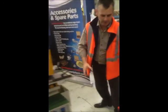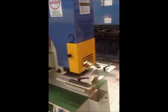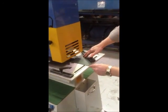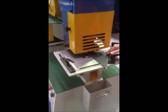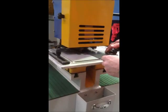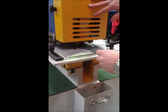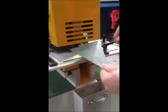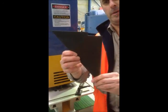On the opposite end we have another foot pedal for our notching station. Just a little bit of 1.5mm sheet metal here. Again set up on your guides with our pedal — and we can notch, as you can see. Nice big guard there to keep everything safe. Now we have a nice little cut-out for you.